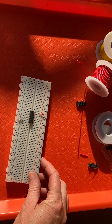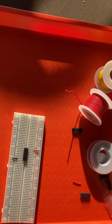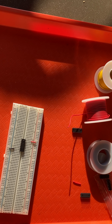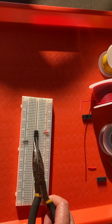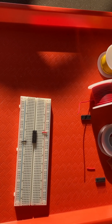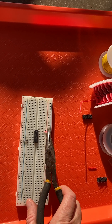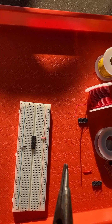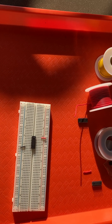My chip will be powered once I electrically connect these sides and jumper the bottom rails as well. That's a quick introduction to what a breadboard is, how to get started using it, and how to bend little jumper wires. The next video will cover how to wire up the logic inside the circuit — that prime real estate inside the board is where we do the actual logic work, and we'll wire it a bit differently there.